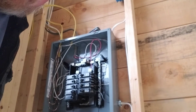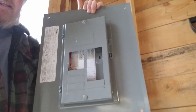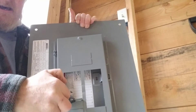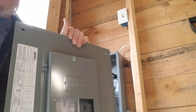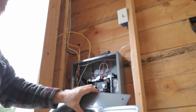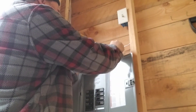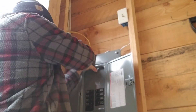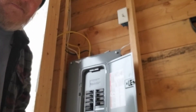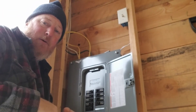We've got the breaker on, knocked the panel knockout out, and the panel cover goes back up. I like to open my door so I can see my breakers, line it up, then get a screw started up top and another one on the side — that holds the cover while I get the rest of the screws in. We're going to tighten these screws up, turn the power on, take you back in, show you the water trough, put the water heater in the trough, and wrap this up.